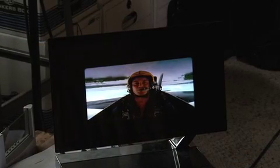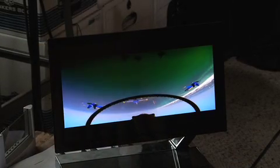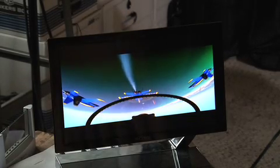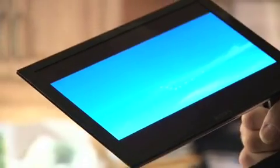The actual display is 0.3 microns thick. Just to give you a scale, your hair is 50 microns in diameter, so this is on the order of one hundredth the thickness of your hair. If I have a film like that, I do not need a very thick substrate to grow it on. Indeed, this whole device is only 3 millimeters in thickness.